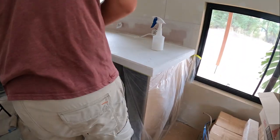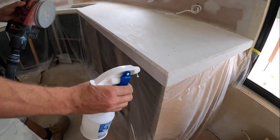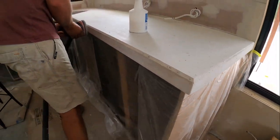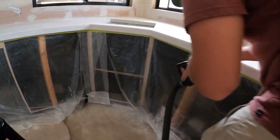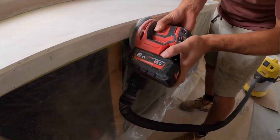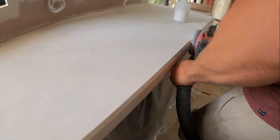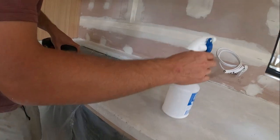which isn't ideal when you have white concrete. The problem was, I think we had a grouting agent on there, and the grouting agent, I'll put some footage of us using it, is a solution you mix in with water and you spritz it on the concrete, and it mixes with all the fines in the concrete as you grind it with the resin pads, or as you finish it with the resin pads, and it makes a grout basically, and it fills in any crevices, cracks, chips, bubbles, anything in your concrete to make the surface really, really smooth and to fill in any texture. And it worked really, really beautifully.